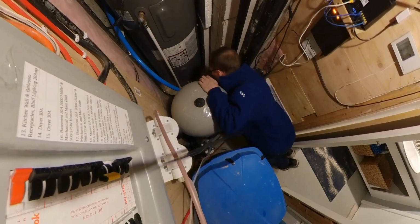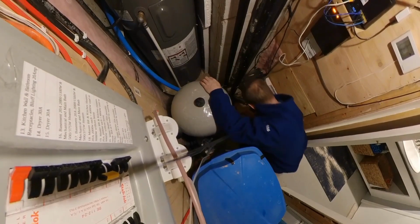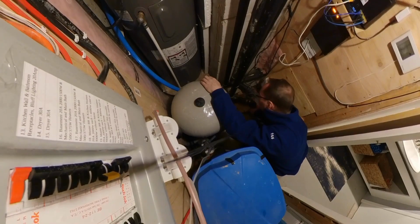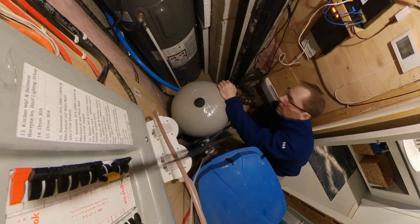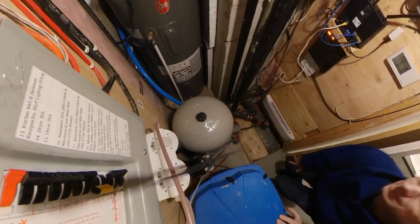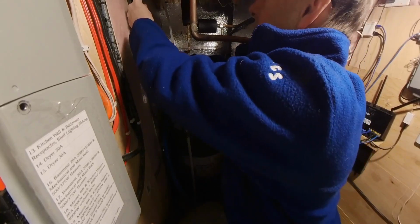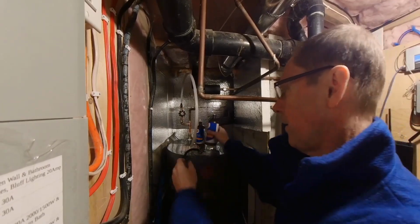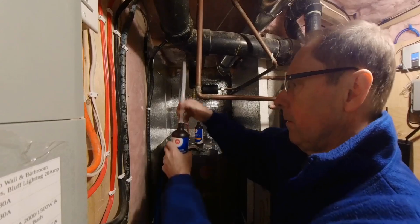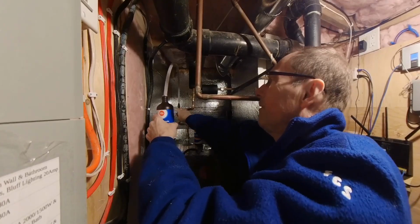So I'm going to back off the pressure on the water heater by draining a little bit into the sump until it starts to dribble. And then I should have a bit of negative pressure. So it's dribbling. Now I believe if I open this, all right, we'll see if this works. So, whoa, oh, peroxide all over my, fortunately, cottage.